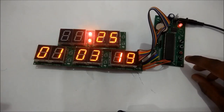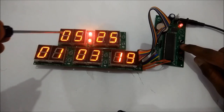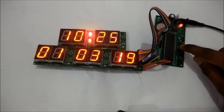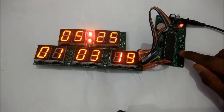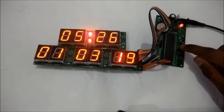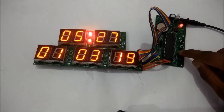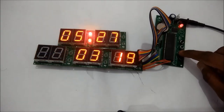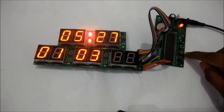Click this button and now the hour display starts blinking and the LEDs have stopped blinking — we are now in setting mode. Using the two push buttons you can increment or decrement the value. Once the hour is set, use this button to move to minutes — now '25' is blinking. You can increment or decrement it; let's leave it at 27. Then similarly you can set the date using this button, and the month using the next button, moving from one display unit to another.